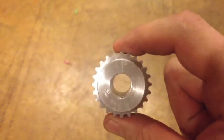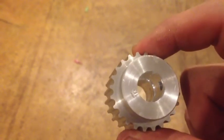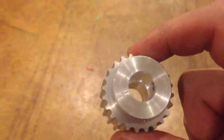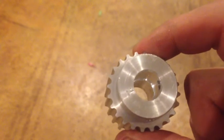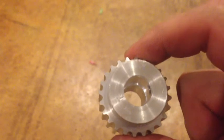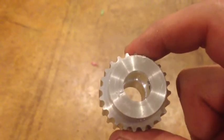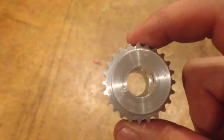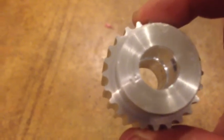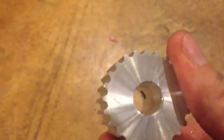So here we got it. I went in and bored out this side with the set screws first — I can see that ridge inside. I had to flip it over and do both sides, and it turns out I did this side a little too wide. I was basically just boring it out and then seeing if it fit, boring out and seeing if it fit. And then I realized the way I was actually turning the piece is the wrong way — I was shoving the whole piece inside and trying to gradually go in the sides. It's probably better to go in a little at a time and slowly work in and out of the piece. That's what I learned. And then I got this side, and this side actually fits a lot better — you'll see no ridge on this side.